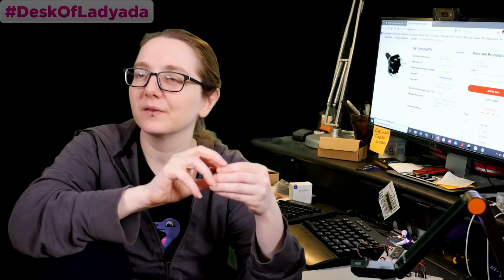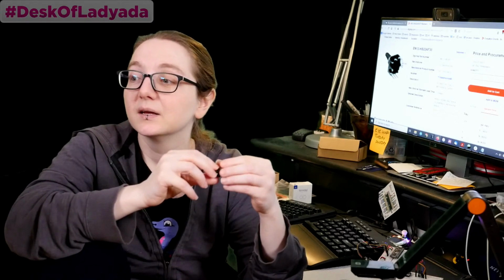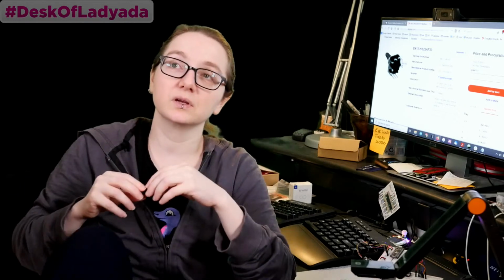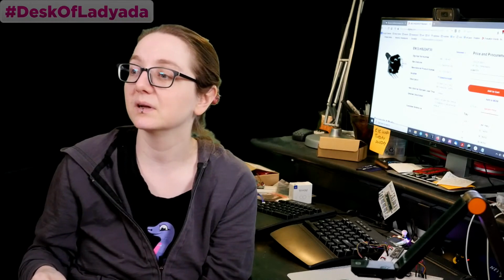We're still working on the SPI stuff, but ideas. Okay. Like the rotary encoder for a keyboard I2C would be cool, and a chance for two encoders on QT Py. You can have two encoders on a QT Py. There's enough pins. You'd have to just wire them up and then write the code for it. CircuitPython supports it.